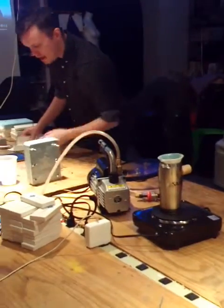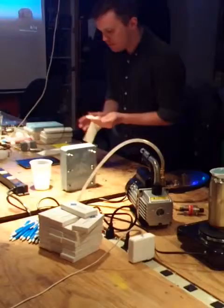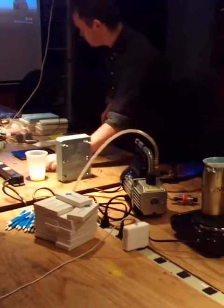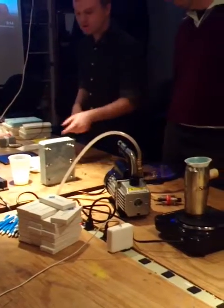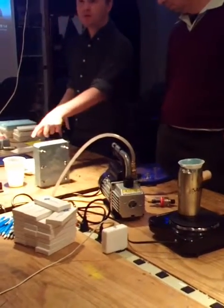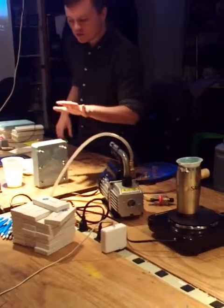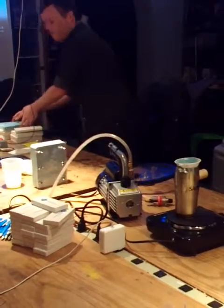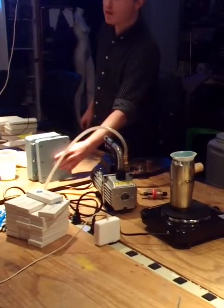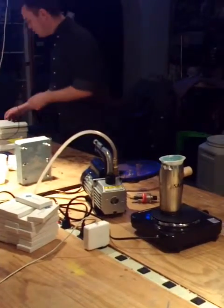Because it only has half the wax. Oh, yeah. So I can show you one I prepared before, so you get an opportunity to look at the internal structure. What remains to be done on this one is to wait. It's best to wait with the cup that you poured out, so you can check when the gel time happens. And so this part gets peeled off and replaced with this part. It's left on the back, and then you just pour the other layer of silicone in, and then you wait a full 8 hours for the whole thing to cure.